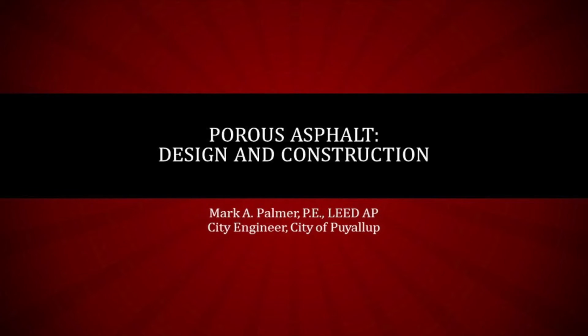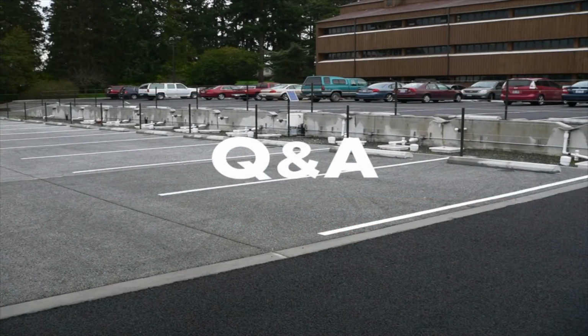The question is, how do I measure temperature when we're doing the compaction and installation of the porous asphalt? There are several tools you can buy, and we just bought one that's like an infrared sensor, and we can check the temperature of the asphalt as it's being compacted, make sure we're in the right range. You want to do that as soon as they get it out of the hopper and they've spread it out, check to see what that temperature is, and check it when they're rolling it, because if it is too hot, they need to stay off it till it cools just a little bit.